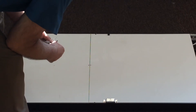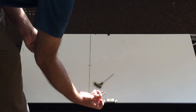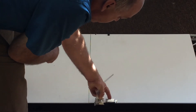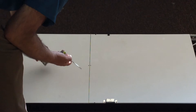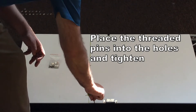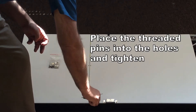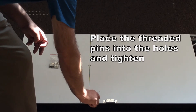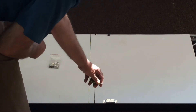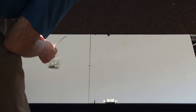When the board arrived, it came with a little hardware kit — a small Allen wrench and some pins. There are also some brackets in there for hanging the flashboard. For our purposes right now, we want the pins and the Allen wrench tool. Start the pins in the back and they thread in. As it gets tight, you can use the tool, but it may be loose enough to tighten with your fingers. Ultimately, we put the tool in and tighten those pins down. Once we have all the pins in all the holes throughout the back of the flashboard, the flashboards are ready to be attached to the blower.